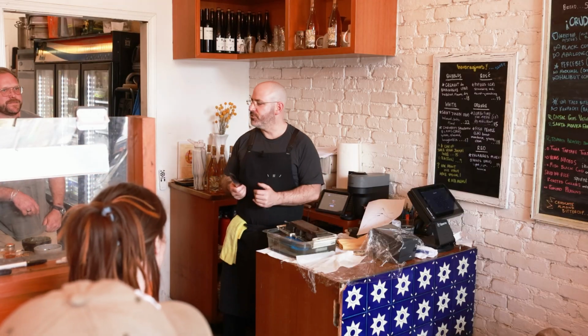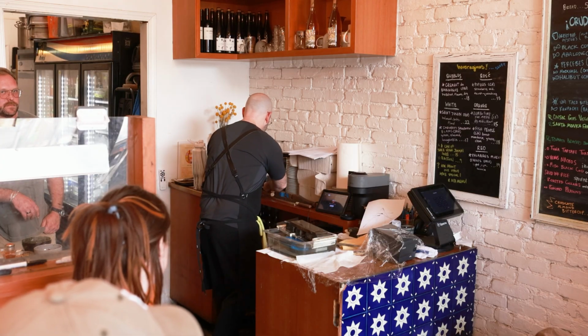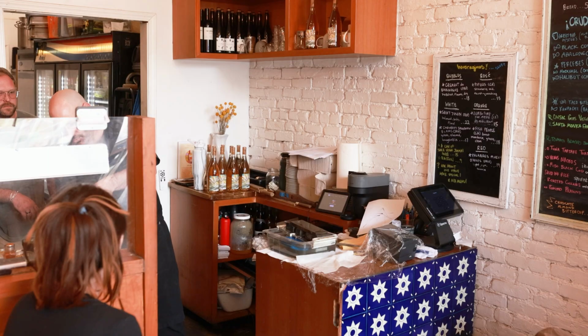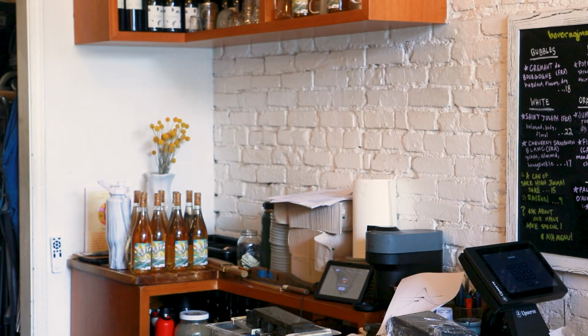Another thumb test that's kind of useful is to take the edge of the knife. I'm going to do it on this one because it will be easiest to see. Take the edge of your knife and you can flex it down against your thumbnail, and you can see here, you see how the edge deforms under my thumb pressure? Right? So this is a function of edge thinness, right?